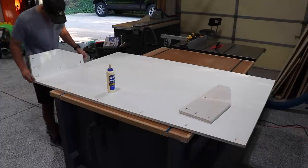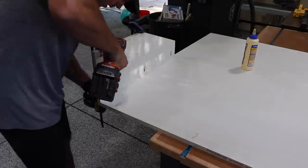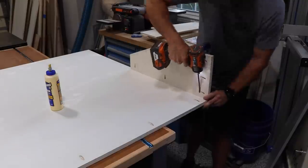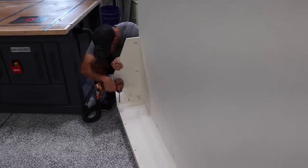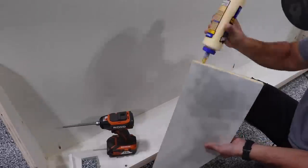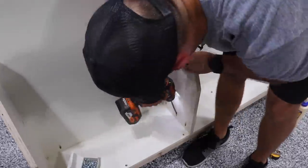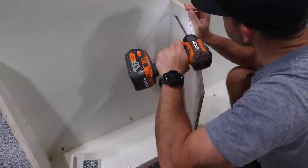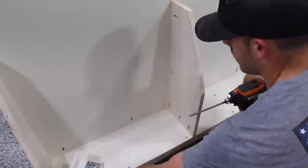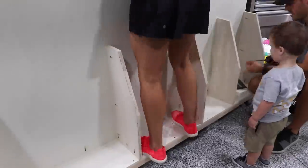And now the quick part — putting it all together. Because we did a lot of the prep work ahead of time, the assembly process should be really quick. I didn't drive in the pocket holes along the bottom edge of the long back panel just yet. I'm going to wait until I get all of the vertical dividers in first, so that when I drive in the screws from the vertical divider, it'll pull that back panel into square.